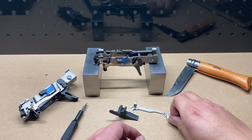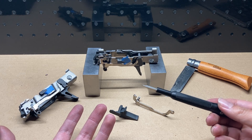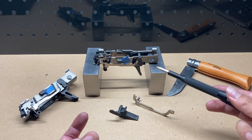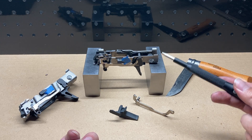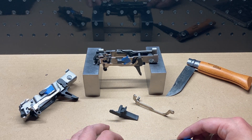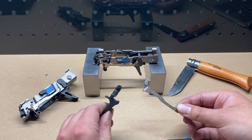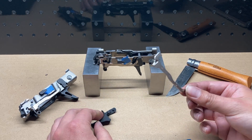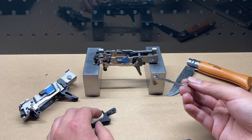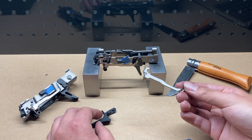To summarize, I have demonstrated a much easier-to-perform test to determine if your FCU demonstrates the disconnector-like behavior that seems correlated with not failing the full sear movement test. I have not yet determined a reliable way to configure an FCU with commercial off-the-shelf parts to produce disconnector-like behavior — right now, it's just trigger bar roulette. We're closer to determining what is really happening to cause uncommanded discharges out of P320s, but the search for a reliable fix continues.